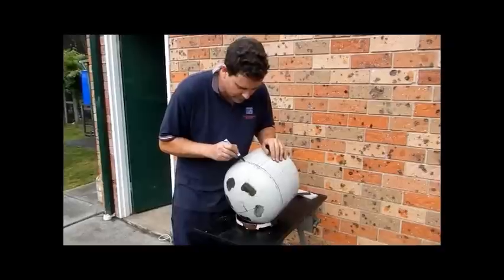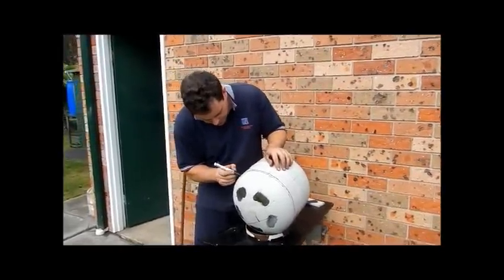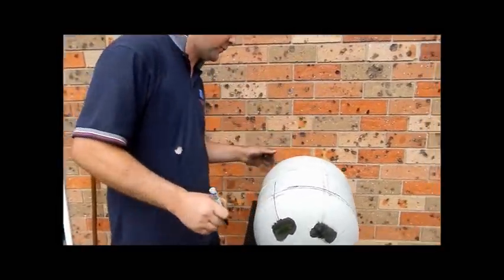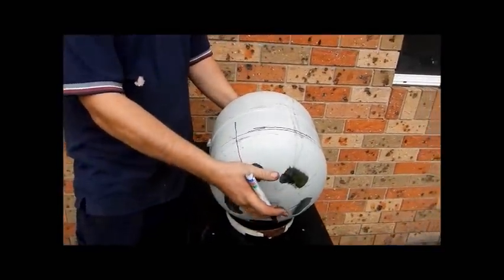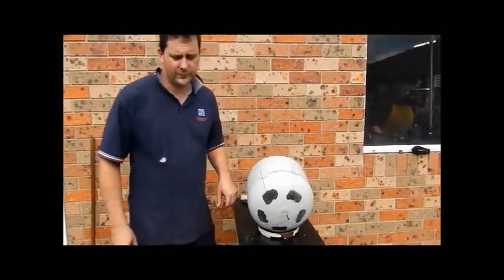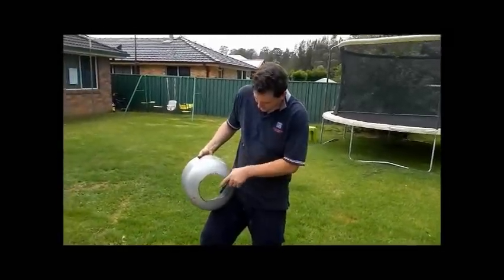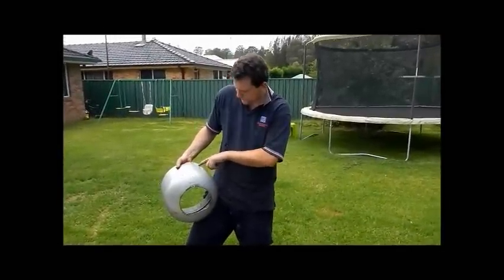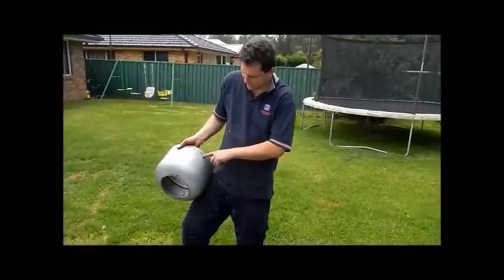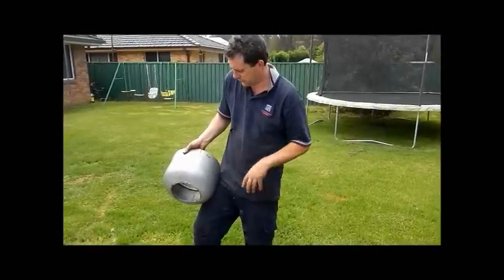And the other thing to do is to put a line across between the two pieces, so down the track, when we go to put that back on, you know where it came off. Because that'll mean the door is still lined up. Burner port, you're going to work at about 30 degrees, and we're going to drill a hole basically where the weld is here. That's big enough to put the burner nozzle in.